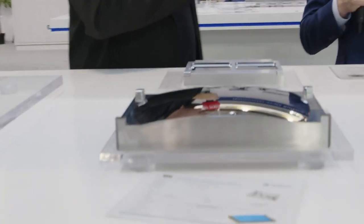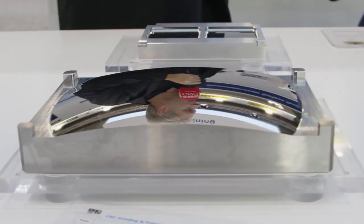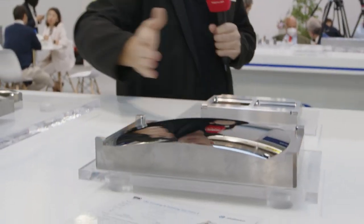What we need to do is showcase some of these absolutely amazing components. First of all, these two here — mirror finish. Talk me through it. On the end we do with a cutter a high finishing surface. We're looking to have a PCD tool on the end, and with a PCD tool we managed to have a nano surface — sub-micron level. That is absolutely amazing. You can see all these mirror finishes here.